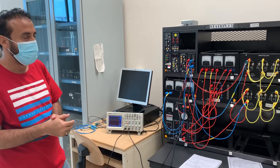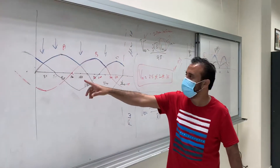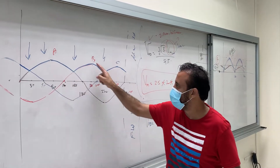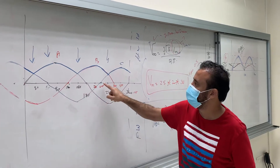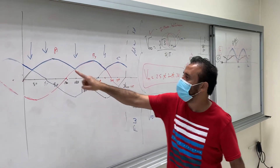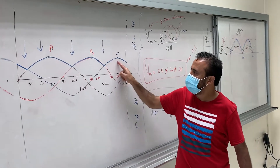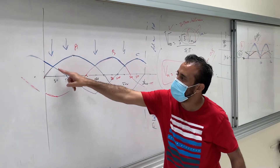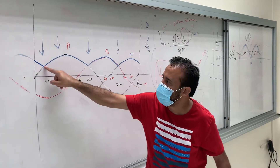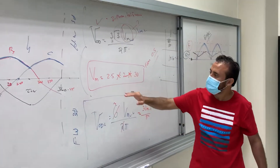Here is the three-phase display. Phase one (A) starts at 0°, phase two starts at 120°, and phase three starts at 240°, then closes back. As explained in the theory, the output limit is 360°. I have one, two, three pulses. The conduction angle: alpha is 30° and beta is 150°, giving a conduction angle of 150° − 30° = 120°.